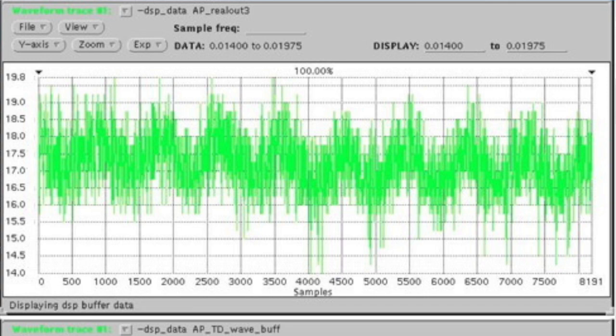In the CMRR test, they were measuring the output of this op amp. They put in a relatively high value and got a relatively high value out, and then they put it in to both inputs, and you get a very small signal out. They were capturing, I think, 1,000 samples for 1 cycle of the wave, 1,000 cycles, and it was a 10 kilohertz wave. They got terrible numbers because the wave is just noisy as hell, so they couldn't use that.